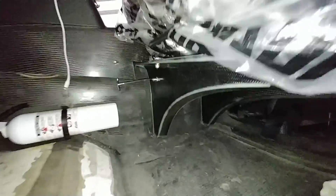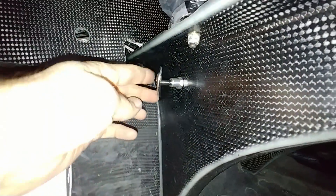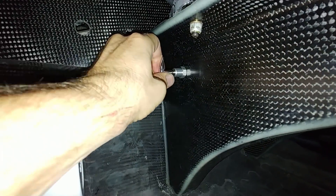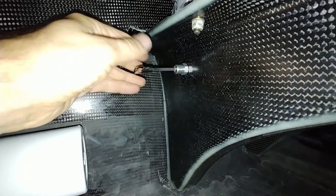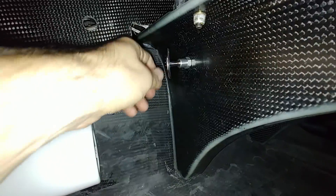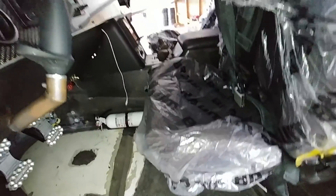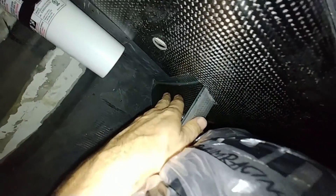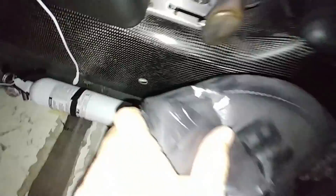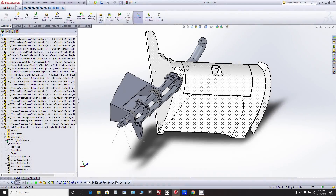The handle is under here — I've got it pulled all the way out right now, but normally you don't have to pull it out an inch and then you turn it clockwise and it actually locks into place. That position there will be where it is when it's actually running. You pull it out to cut off the fuel. When you're sitting in the seat you'll just be able to reach down next to the seat, rotate it anti-clockwise, and pull it out — that'll cut the fuel off. So if there's a fire on the engine it's easy enough to cut the fuel off, and of course you'd turn the fuel pump off as well. That's another job done.